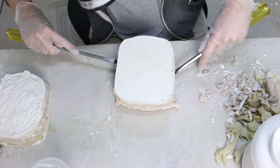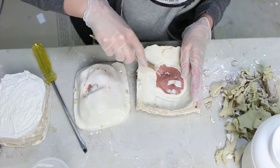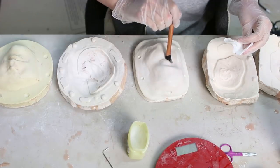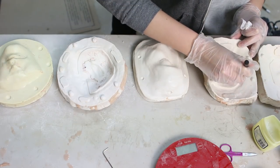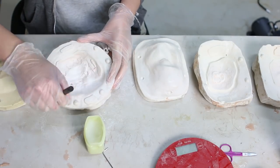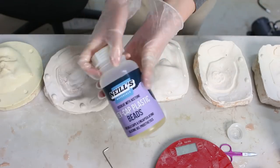Once cured I remove the clay walls — there are quite a few jagged sharp edges that need filing down. Very carefully, I open up the mold by putting in two screwdrivers; luckily it hasn't bonded and there are no undercuts. I clean out the clay with a wooden sculpting tool, and for any areas with stubborn detail I give it a scrub with a brush and some shellite or naphtha, wearing a mask. Once the molds are all cleaned out and filed down they're ready to be run. The first step is cleaning, the second is releasing. I find polyurethane can grab onto cap plastic and tear it, so for release I thin down vaseline in shellite or naphtha — adding both into a container, stirring until liquid, then brushing it over both sides of the mold and buffing it in so no thick vaseline impedes the detail.